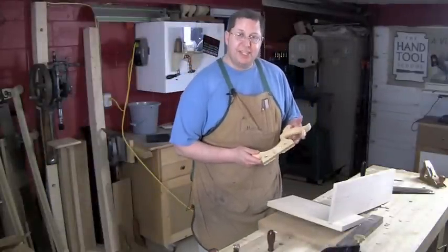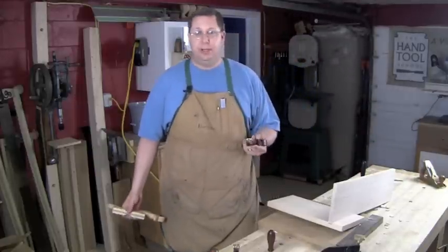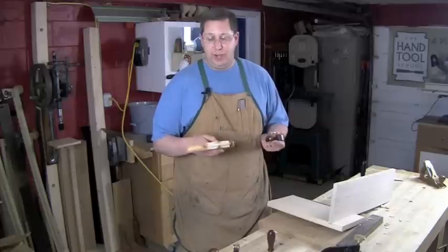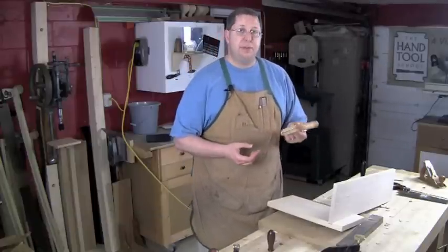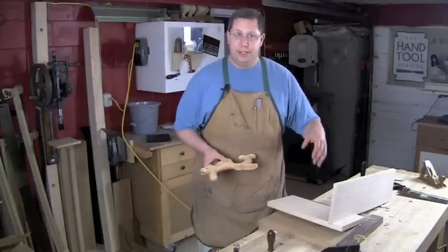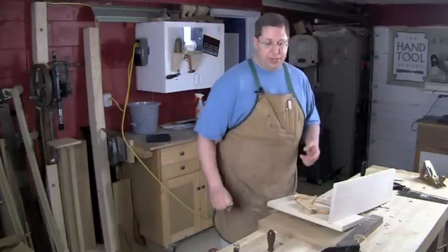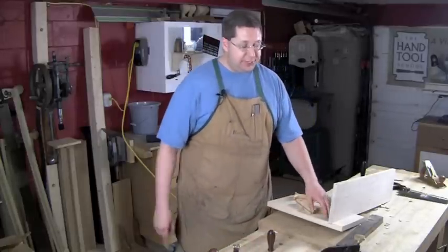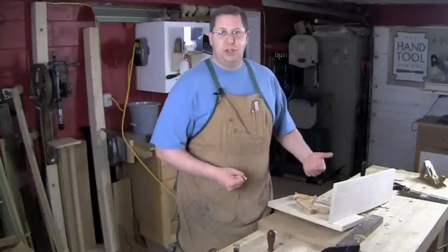So what's the verdict? It's a pretty cool little saw. It's going to take some getting used to for me — the saw cuts didn't go quite as easily as grabbing a regular back saw. I probably would have gone about twice as fast with a regular back saw. But that may just be a usage factor — this was the very first time I used this saw. I'm not going to pass judgment on it; I think it's a hang issue. On a first use to get a dado with dead square, dead vertical walls to exactly the same depth is pretty cool. If I were just cutting a couple of dados, I think I'd still probably go with the dado plane, though the dado plane does have a tendency to get blowout or spelching on the far end.